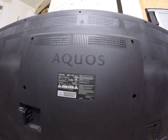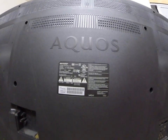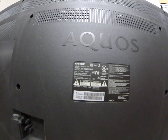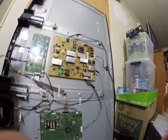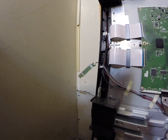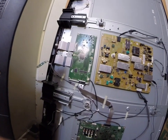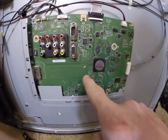Hello everybody. I'm working on an Aquos TV made by Sharp and I thought I'd share my findings with you today. Hope you can read the model number — if not I'll put it in the comments. Anyway, this is the Sharp Aquos, it's a 60-inch TV. The problem we're having is, as you can see from the flashing light, we've got three long flashes and one short, and there's no picture, no backlight, no sound, nothing.